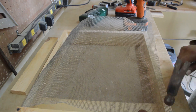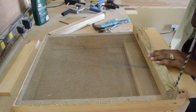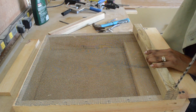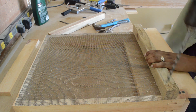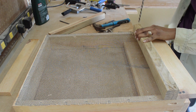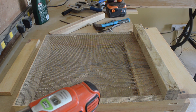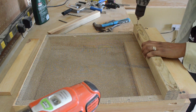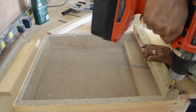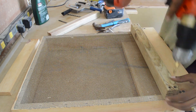Now I'm stapling in the mesh at the bottom. After that was completed, I'm putting on two strips of wood to elevate the box — you will only see me apply one though. I'll pre-drill the holes and then screw in, as you can see.